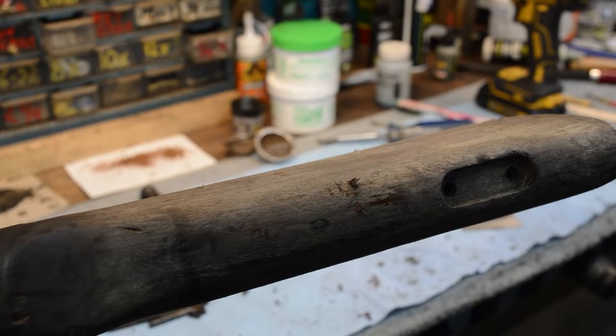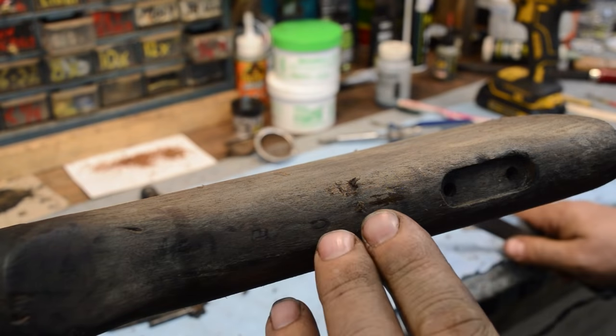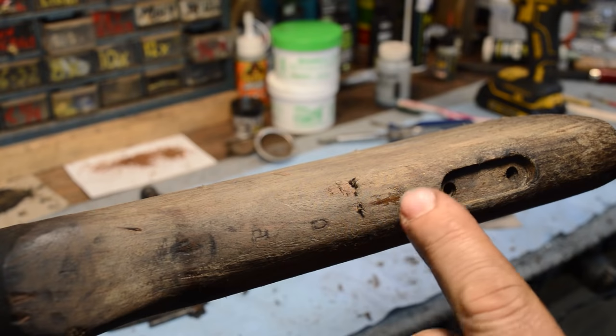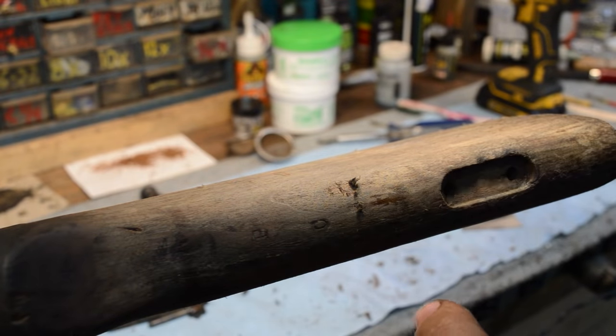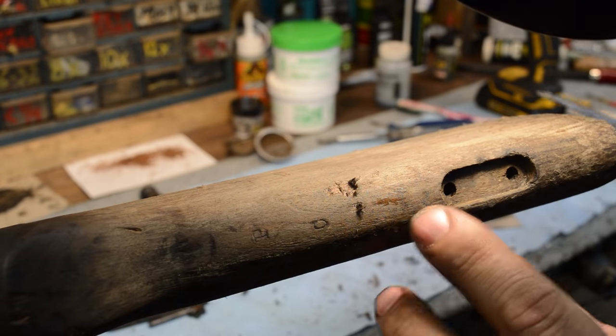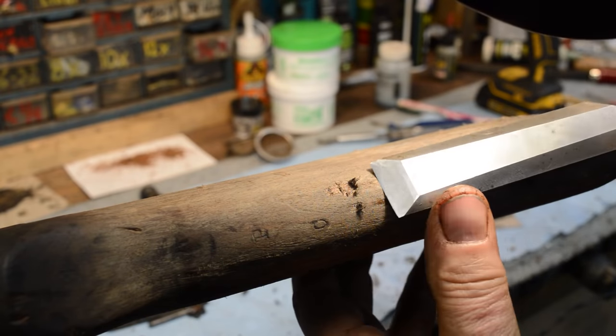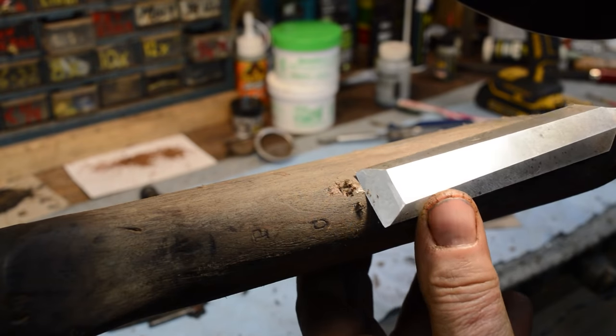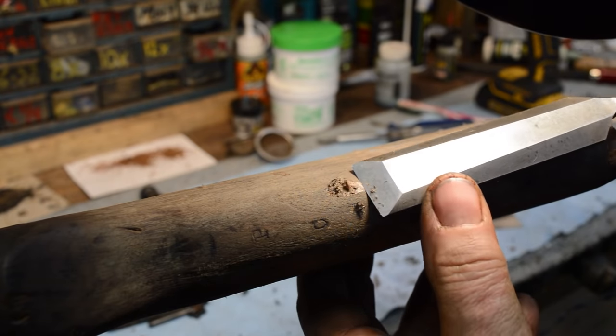In the center of the screen here, there's a very large chunk of wood lifted, and I've got this kind of cross-lit so you can see it right on the umbra. There it is. There's a dig. So there it is right across the top. You're not going to be able to put that back. That's not going to steam out. That can, however, with an extremely sharp chisel, just be rolled off like this. You can just get down below the surface.